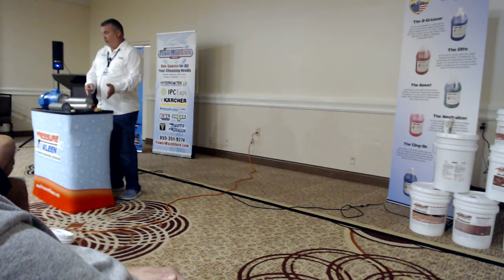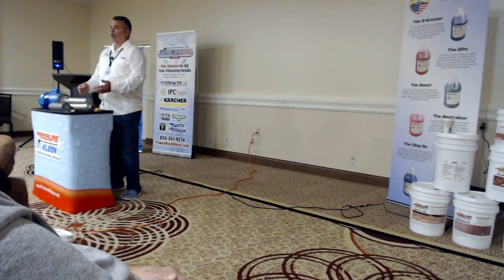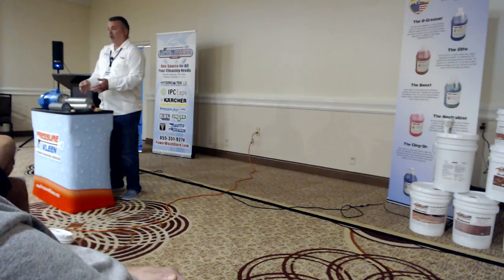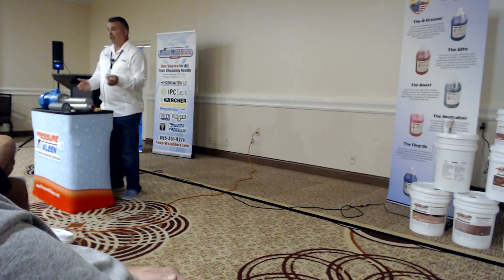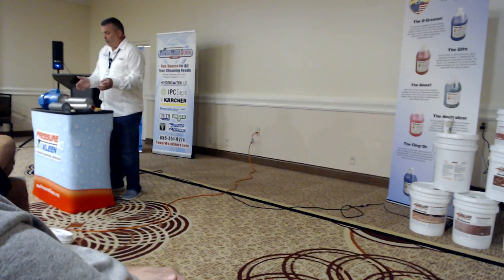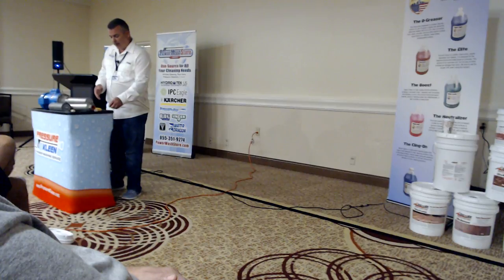When you go to do yours and put it all back in, just put them where they were. It's not super important, but you need to have the same amount of shims in there. Don't stack them all at the front, don't stack them all at the back.